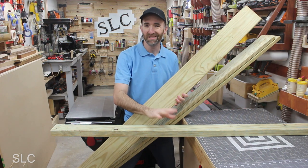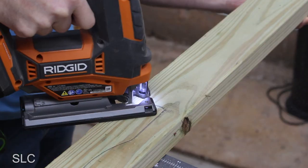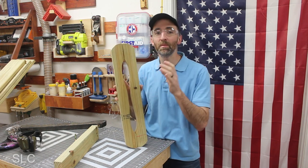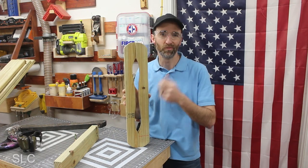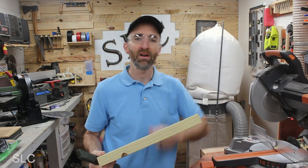This right here is just some decking board and this is a 2x4 — we're going to cut those down to the appropriate size. Using a jigsaw on these they're not going to come out perfect, but I just got to remember that this is going to be sitting on uneven ground, so as long as they're pretty close they'll work. To cut down the pieces for the arm I'm just going to use the remaining 2x4, cut it to length with a miter saw and then rip it down on a table saw.